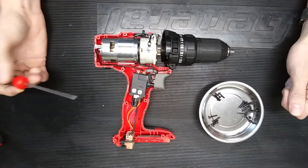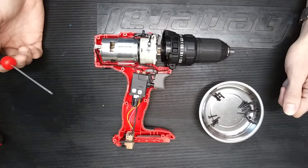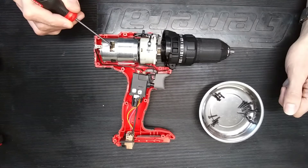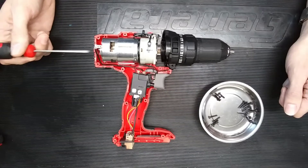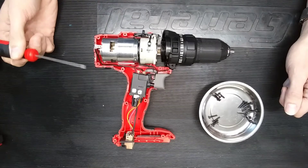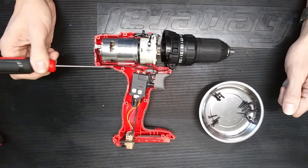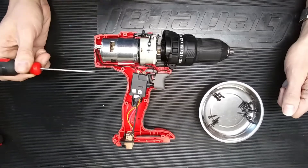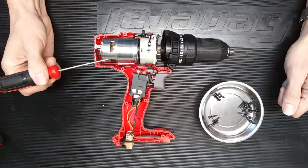Now onto the motor. This is a drawn steel can-style motor. It has a flux ring on the outside and permanent magnets on the inside. There's a centrifugal-style radial fan internal to the motor. This is a brushed motor — I can see the commutator and brushes buried inside. Nice accurate housing typical of CAN motors, so you can hold it nice and accurately within the housing. There are little ribbed features on the outside of the plastic housing that locate the steel motor housing nicely, keeping everything nice and snug.